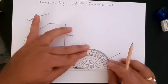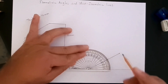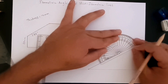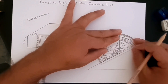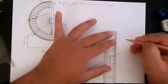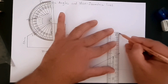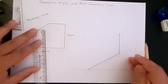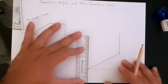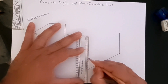We can also create the height which is 50 millimeters and the side height of 27 millimeters. Let's create two lines — one at 90 degrees from this point, and one at 120 degrees. That gives us the vertical line. First let's create the 50-millimeter line, and then the 27-millimeter line — starting at 80, marking off 27 millimeters, it ends here.